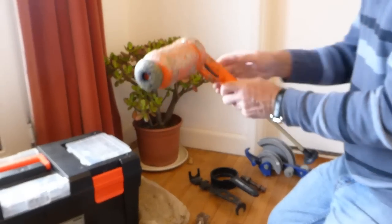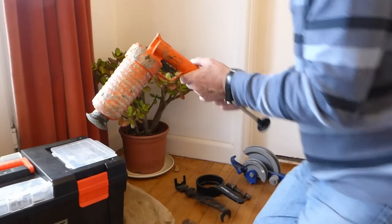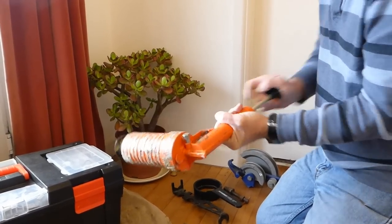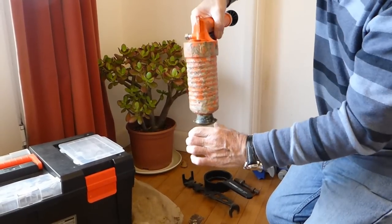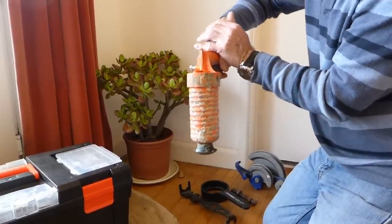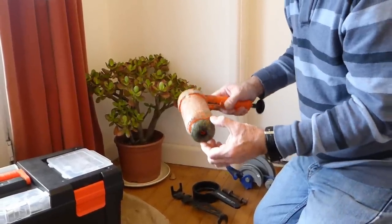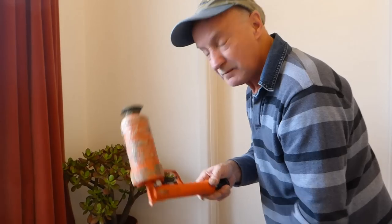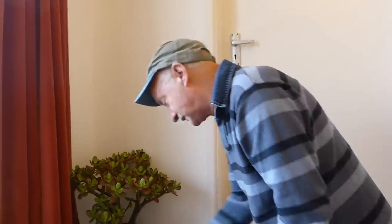This thing looks like a load of rubbish, I know, but it's actually a pressure gun. If you've got blocked sinks - I used to get called around to plenty of those - this is a quick and easy way of clearing them. You pump this up, put that nozzle over the sink waste, or basin waste, or bath waste, and pull the trigger - a jet of air comes out. That jet of air generally clears a blocked waste. Not every time, but nine times out of ten that will clear a little blockage for you, save you a lot of time and trouble. They're only about twenty quid, so if you're going out doing plumbing all the time, it's a nice little tool that I use a lot.